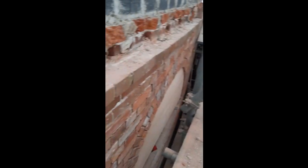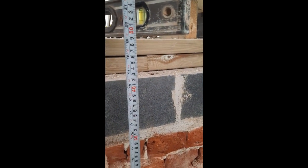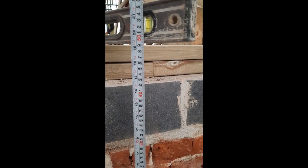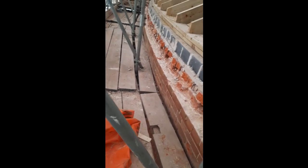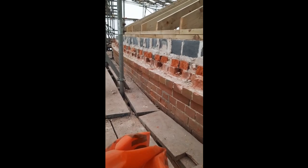So we're at the other side of the opening now — and suddenly we have a drop. We're now at 92, so it's about a 20mm discrepancy there. We can't check the rest because this has still got the oversail coming off, and it still has to be tidied up before we can actually measure those ones.